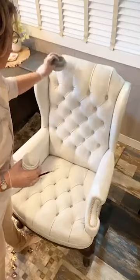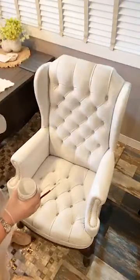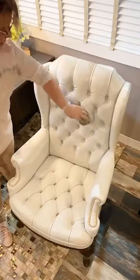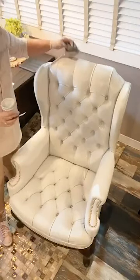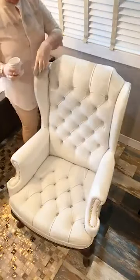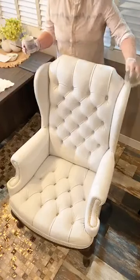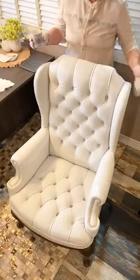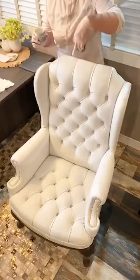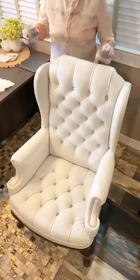Ashley and I both have the same question: why did you not wipe this chair down with a de-glosser before you started painting it? Well, this chair has already been painted — it already has an original bond. Often we get this question: should I de-gloss again? De-glossing is easy — you're simply wiping on a product, just like wiping it down with water. But the original bond of the paint was already here, already established. So I'm really not trying to establish a bond again — it's already there, and the paint is going to bond to itself.